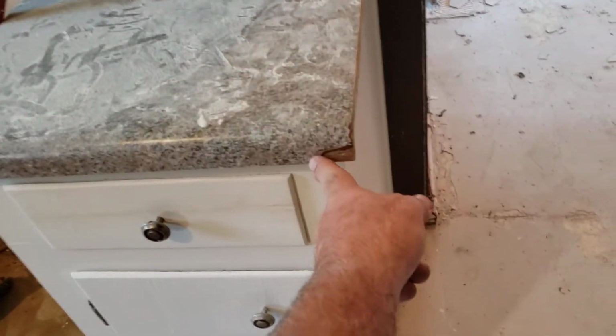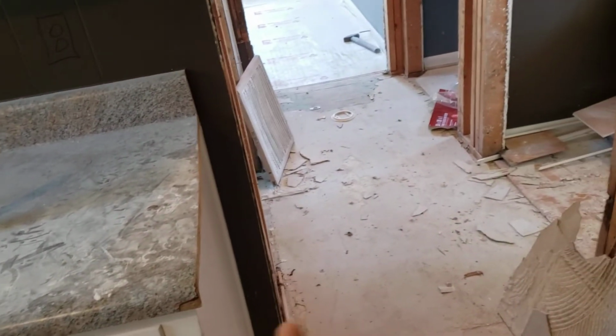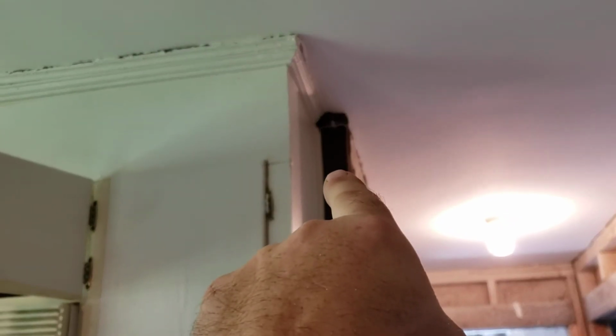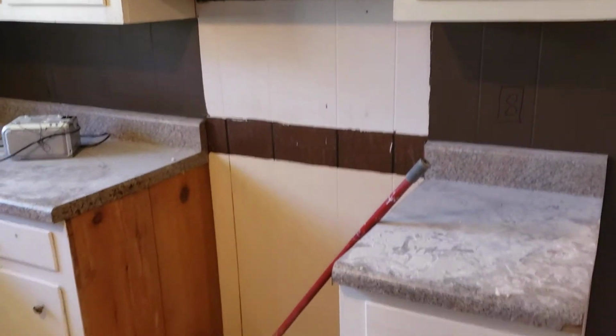You can see how this got eaten up, you know, just from walking by it. So we want to make sure we have plenty of egress right here for people to walk through, and this walkway not be too choked up. But then more importantly, up here, when we do our upper cabinets, that gives me that 3 inches I need for your crown molding return right there, so that the cabinets aren't hanging out into the outside of the wall. So that would fix that drawing, no problem. If we can change that around, then send it to me.